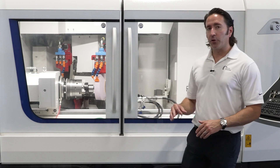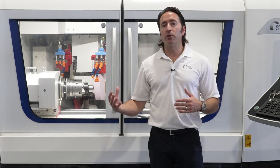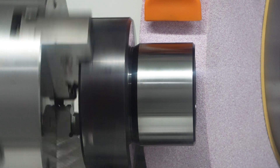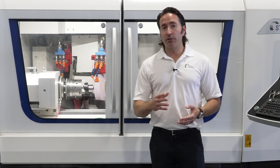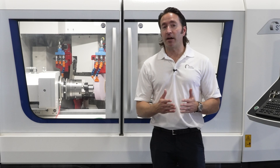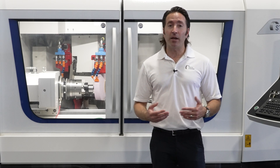So with this machine, we have up to three spindles, and customers can essentially combine three machines into one. We can do OD grinding, thread and form grinding with one wheel, then move to the second wheel to do shoulders, faces, or even simultaneous diameters and shoulders all at once.